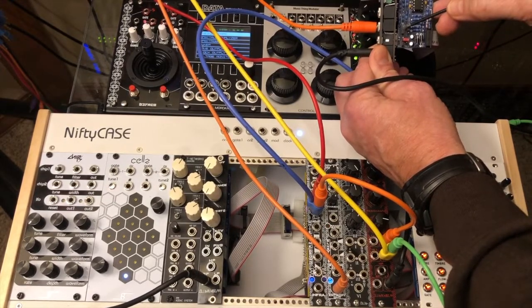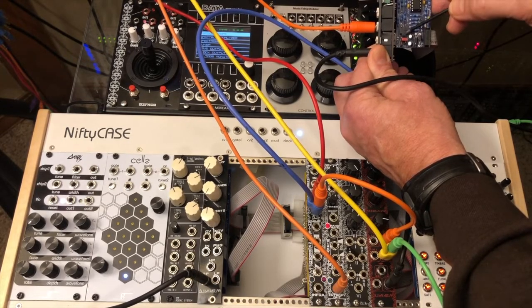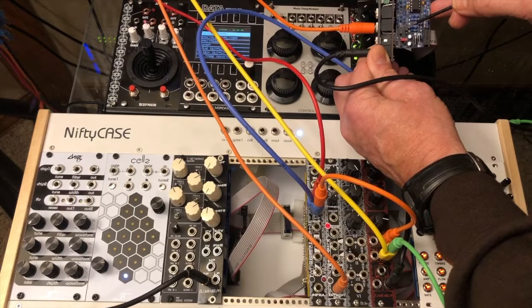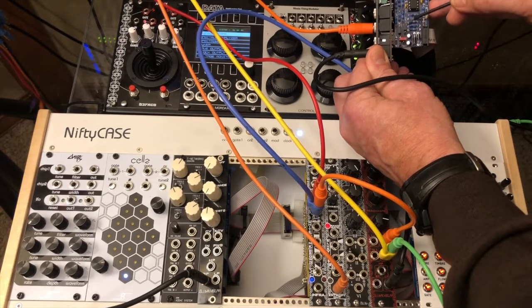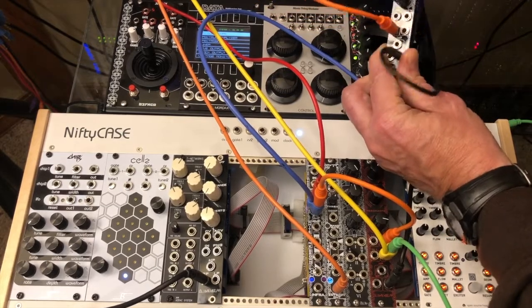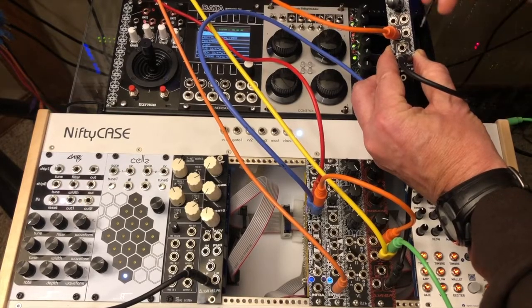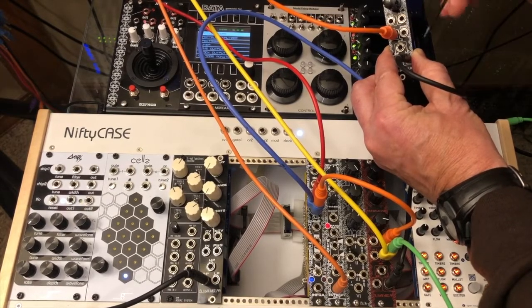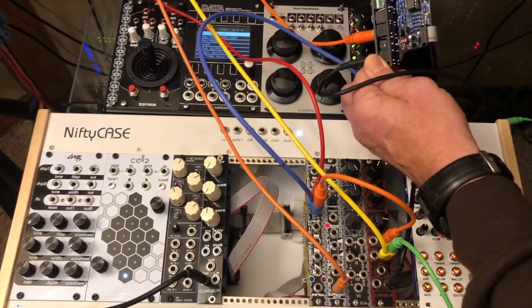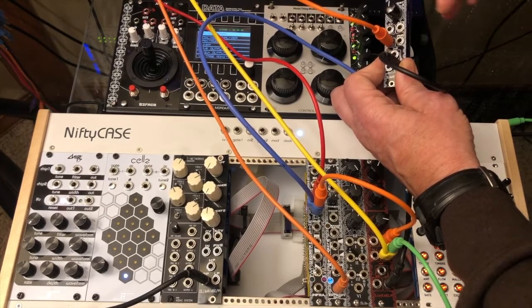And then this is a 3-pin jumper, and it's currently in the bottom position, which is for self-oscillation. If you move it to the top 2 pins, that takes away the self-oscillation. And then finally, this one is over here. When it's on the top 2 pins, it means it's pingable, and if you move it down here, it's no longer pingable, and that is for this input here, labeled PNG. It just becomes a clone of this input, as far as they would operate the same if you have it in the bottom position. So you could have 2 inputs that would just act that way, but now it's pingable.